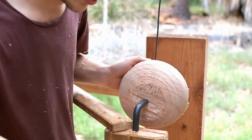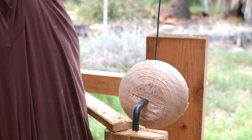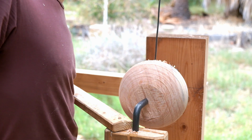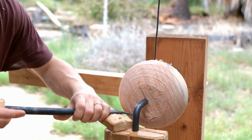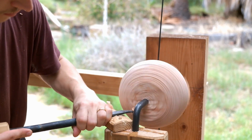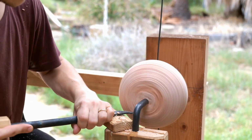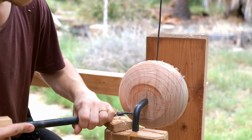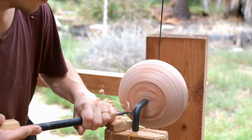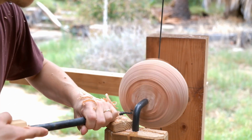You'll notice the bowl isn't jumping right off the lathe anymore, and I'm pretty sure what I did to fix that was making this new mandrel. I was quite careful to make sure that the holes on it are concentric, whereas on the old one of them wore out a little bit unevenly because it was only made out of softwood. So yeah, this is a much harder mandrel, it's a little bit longer. I'm not sure if that's important, but the bowls are spinning much nicer from that alone, and that was a big breakthrough. Just not even to do with the bowls themselves.